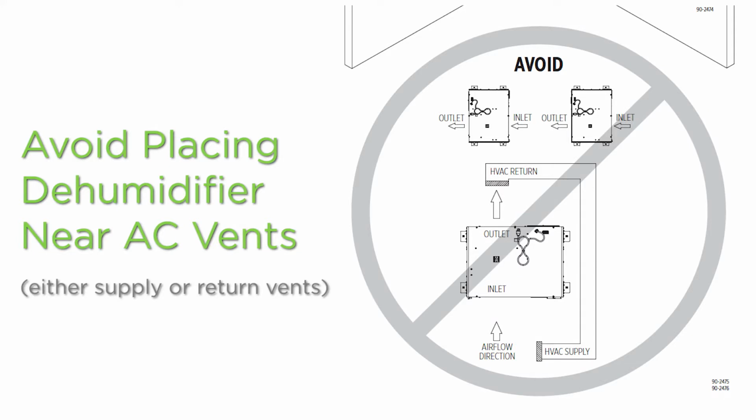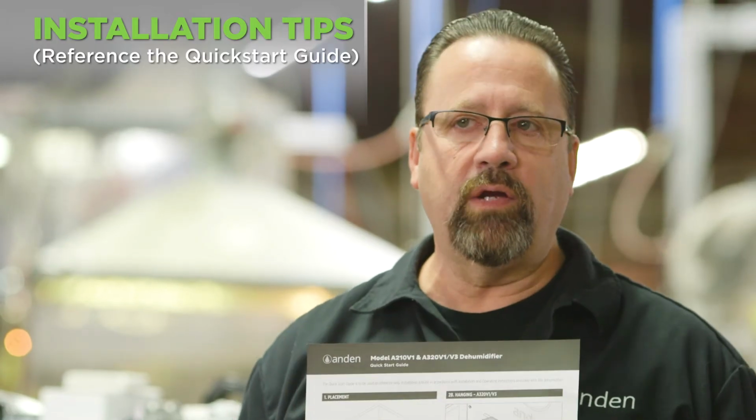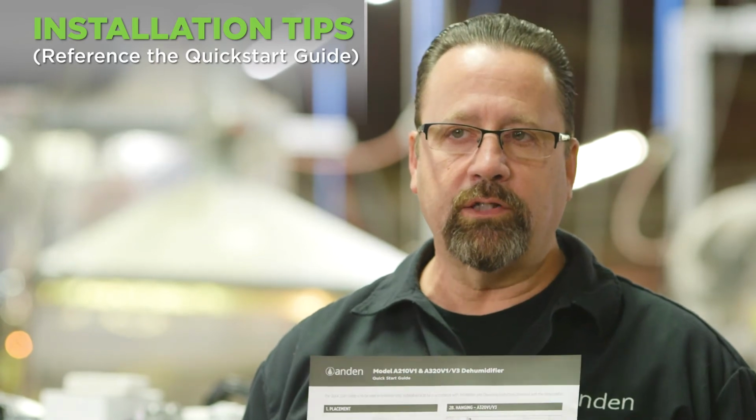The other thing to keep in mind is it doesn't do us any favors if we have the discharge, the supply of your air conditioner in the room blowing into the inlet of the dehumidifier. Again, that is dry air coming out of your air conditioner. Doesn't do us any good. Try and keep our inlets and outlets away from each other as much as possible.